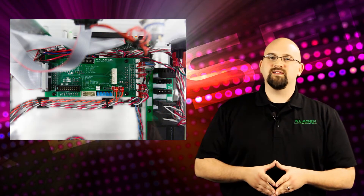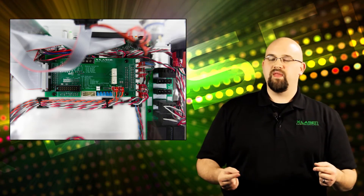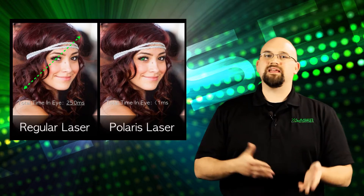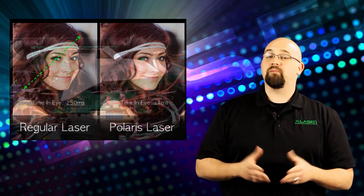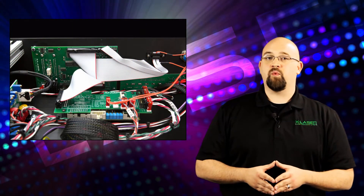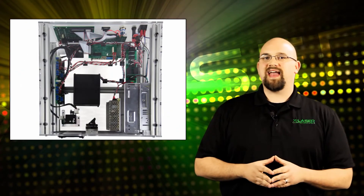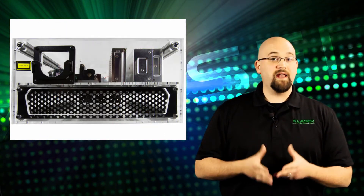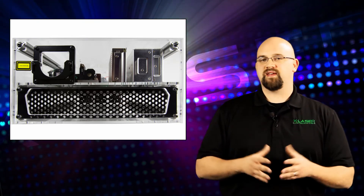The second part of the hardware is circuitry that's designed to monitor the health of your laser and keep the beam moving faster than a set rate. If we force the beam to move out of your eye very quickly so it can't leave very much energy behind, the irradiance drops even further, making the show even safer. We do this with another patented technology called PASS, or the Professional Audience Safety System, for which X-Laser is proud to be one of only two certified integrators in the world. The third part that makes all of this work is the actual integration of all those systems within a projector platform. In order for audience scanning to be accomplished safely, the hardware inside of a projector must be very carefully specified and built to control heat, facilitate communication between the components, and be robust in the right ways to really protect the system.